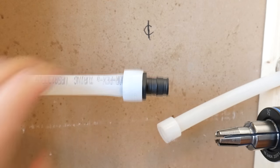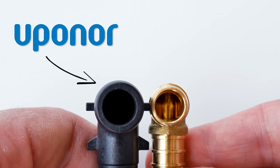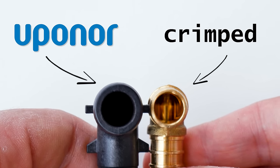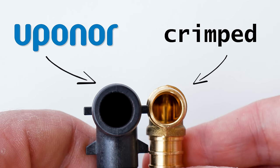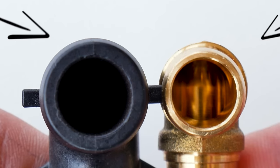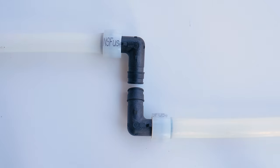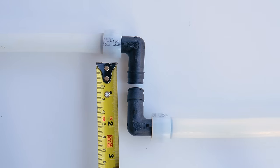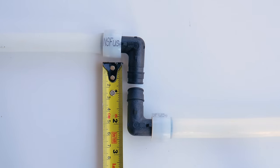The joint is complete and ready for testing — it's literally that simple. What's nice about Uponor fittings is that they're full port compared to other PEX fittings. Crimp fittings, which use PEX B, have a smaller diameter compared to Uponor's PEX A fittings, which allows for better flow and means you wouldn't get any loss in pressure when other fixtures are in use. If you need to make a connection with two fittings that are close together, there is a minimum length of pipe to respect and each joint needs to be fully expanded before inserting the fittings.